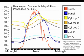If you look at the yellow line — the water temperature from left to right — it cools off gradually at night because no insulation is 100% good. It cools off quite a bit early in the morning because cooler water than the top is being added, but you can see the grey line at the bottom of the cylinder rises up. It rises steadily till mid-afternoon and then falls at about the same gradient. You end up in the evening with water at just over 70 Celsius in the cylinder, just as you did at the beginning of the day. It's a self-sustaining, self-correcting system. You don't need to switch the pump off to control overheat.